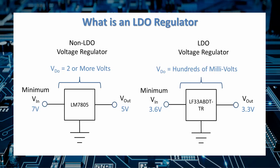This makes LDOs ideal for applications where the supply voltage is only slightly above the voltage required to operate the circuit, which is common in circuits powered by lithium-ion batteries. While the battery voltage may start at 4.1 or 4.2 volts, it drops to 3.7 volts rather quickly, then down to 3.6 volts before most electronics cut out. One big advantage of LDOs in battery-powered circuits is their much smaller quiescent current. Most LDOs have a quiescent current around one milliamp when operating, dropping to just a few microamps in sleep mode.